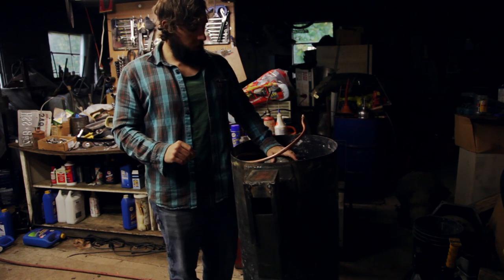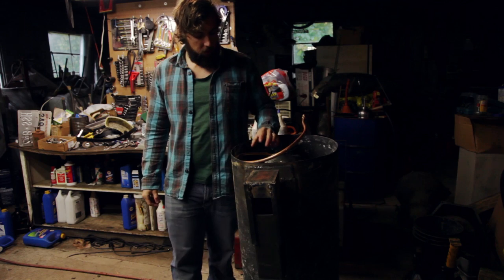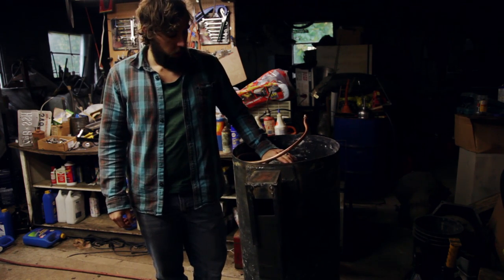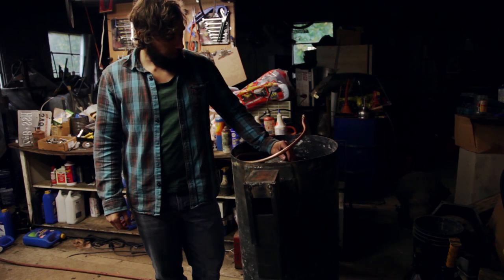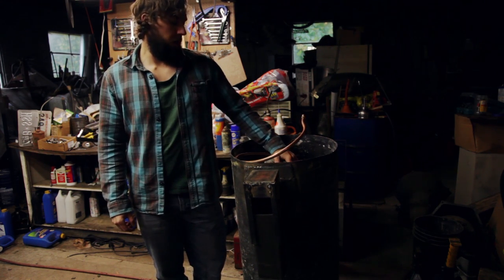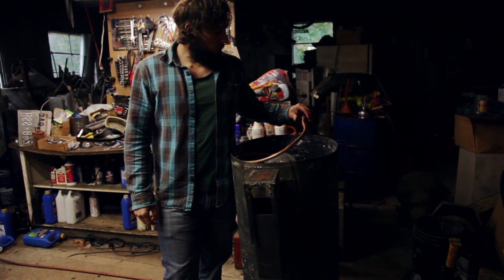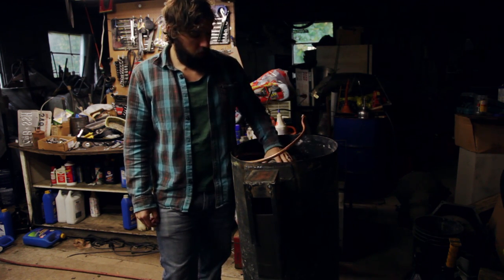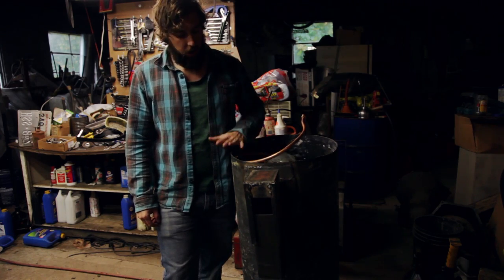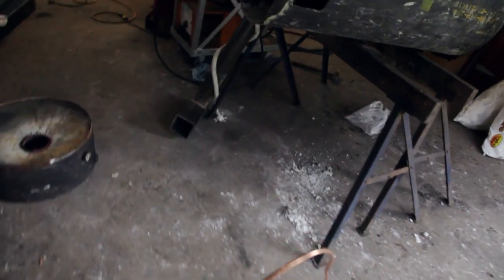We knew we didn't want to heat the bus with purely propane heat, so we decided to make one of these rocket stoves that I see a lot of people online make. And because we didn't have a lot of mass in the bus to store the warmth, we thought maybe we should store the warmth in water. So we figured, why not heat water with the stove and store it in another hot water heater tank, and also heat that water up before we go into the instant hot water heater. So that's what we decided to do.